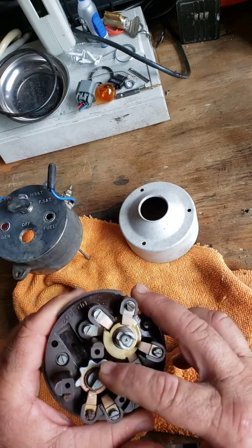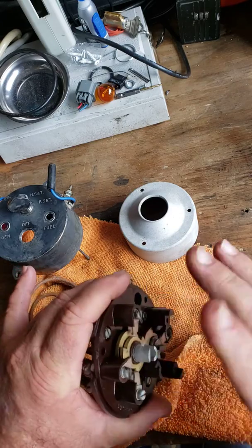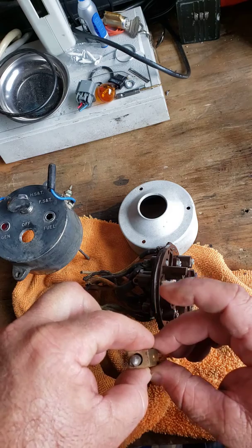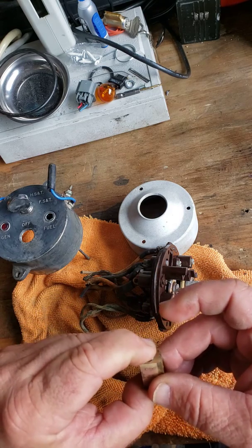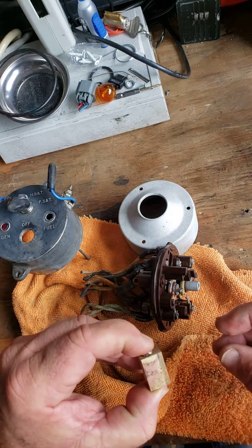What we had to do — the headlight switch, this is the headlight switch here. This turns. We finally got that one to work. But the problem was the ignition. What was the problem in the ignition? This is a brass housing with a spring and that ball. You can see that ball right there. It was so corroded that it bound itself up.